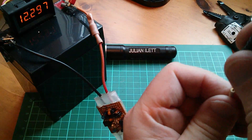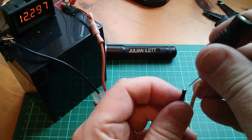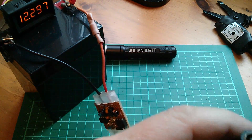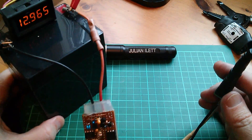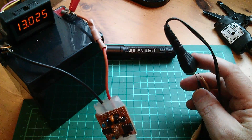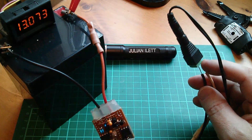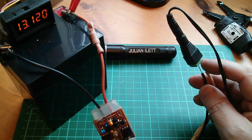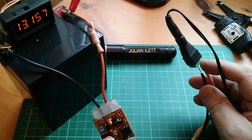Let's attach this connector again so I can put the solar panel simulator back on the input side. Here's the wire — and up goes the voltage. The MOSFET is turned on, it's passing current through from the solar panel to the battery. If I let that gradually climb up it will eventually reach the float voltage of 13.5. This should now do a 1-2-3 flash: 1-2-3.